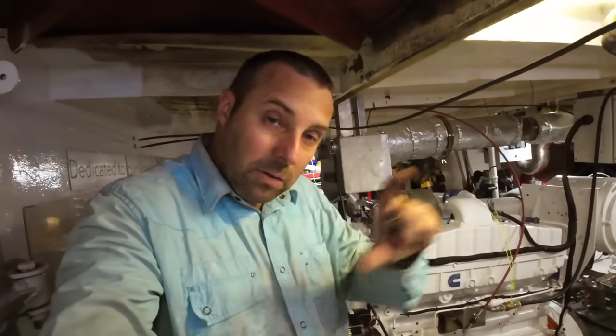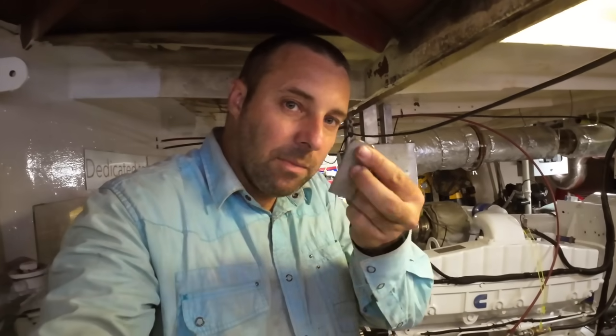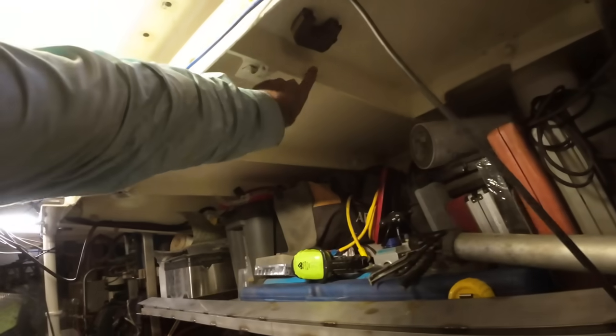To get the stainless doors that we're going to build to go into these tracks, the top and bottom two tracks, I need to make one of them removable. I'm going to make the top one removable, obviously, because we welded the bottom one on. Now to do that, I've made four of these little stainless tags. So I'm going to weld these vertical onto the back of the track that we've just built, and they're going to bolt to the ribs that live up here.